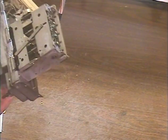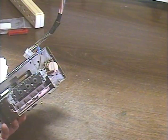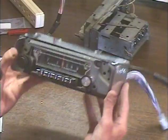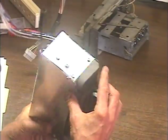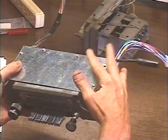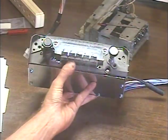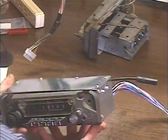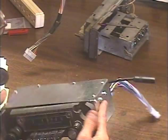This customer sent even less than that because someone had stolen all three coils out of the tuner, so I was forced to grab a coil out of a different type of radio and put it into this Plymouth Trans Audio unit. Since it came without a cabinet, I do have about 25 years of experience in the HVAC trade — which means making things out of sheet metal all day — so I made this quick little whip-together cabinet. I made it as small as possible so there are no hassles with installation. Some of these radios have a rear support, but this is 28-gauge steel so it's not going to add any appreciable weight.